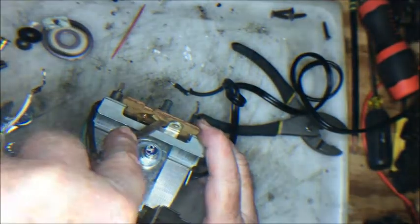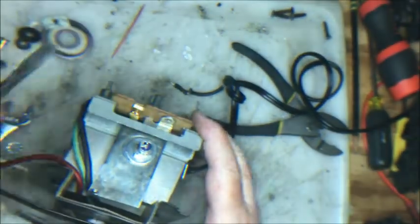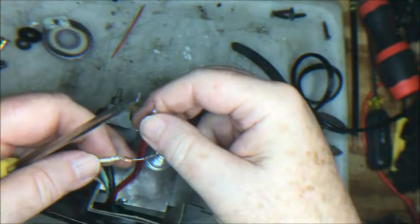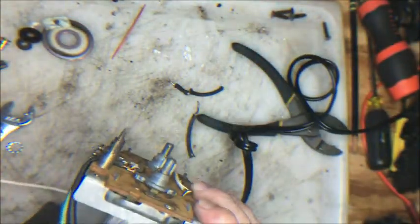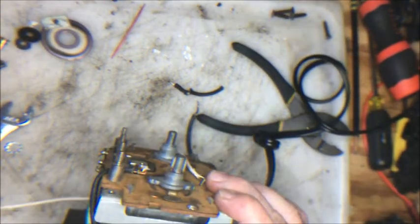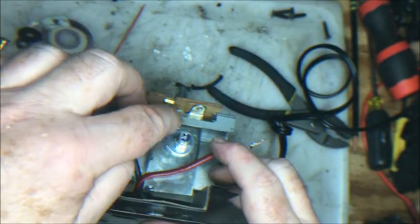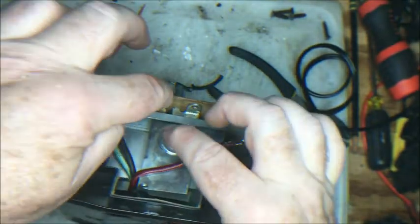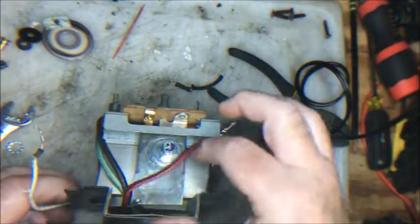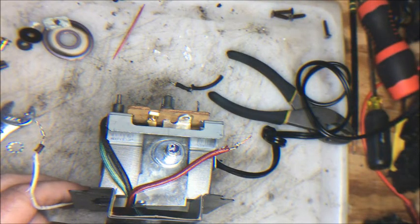This is my connecting point. Right there, I'm going to run a wire from here to there. And then we are in good shape. Then I will reconnect the resistance wire and the rectifier wire over there. Very good. We're in very good shape right now. So I'm going to cut a small piece of wire to connect to these two pieces and then solder them in. And after I've got these two points soldered in, I'll put these back together, and then let's see how the whistle blows, okay? I'll be back to you when that soldering is done.